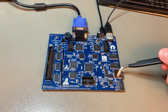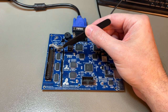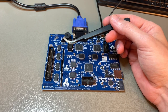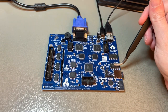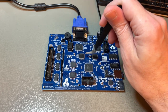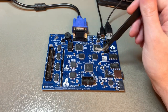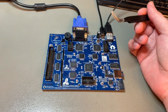All 64 kilobytes of address space can be used for user programs and variables — the BIOS takes no address space. This other port is just a micro SD card port. The bus expansion is a 40-pin connector with the entire address bus, the entire data bus, and specific control signals that make it DMA-capable. DMA stands for direct memory access, so whatever you connect here can access all the memories of the system.